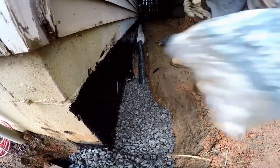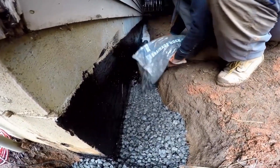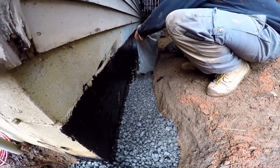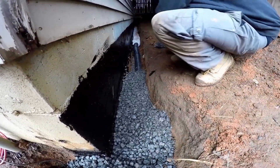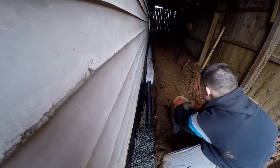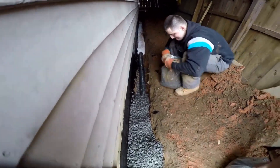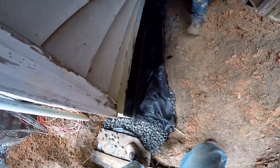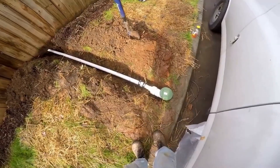We're finishing up with gravel by the bag. We've got a basic gravel layer underneath the pipe, and now we're pouring gravel on top of the pipe to cover the footer so water drops off the footer down into our system. You can see we've used two pipes here — the new EasyFlow product with peanuts, then switching back to gravel near the sump pit. We've got our fabric soil separator down there, sticking up against the tar, and now we're backfilling this area to finish up.